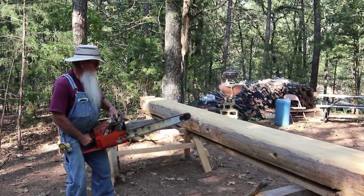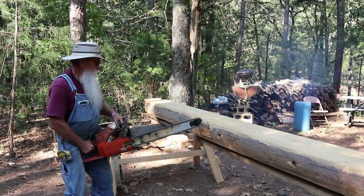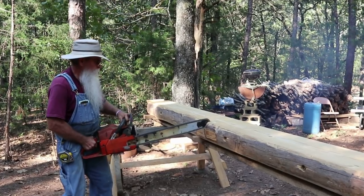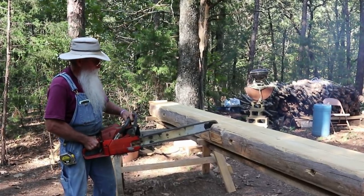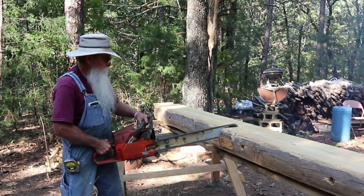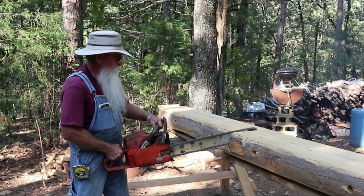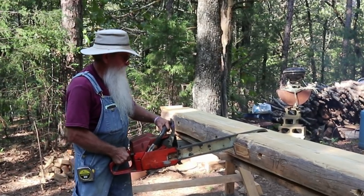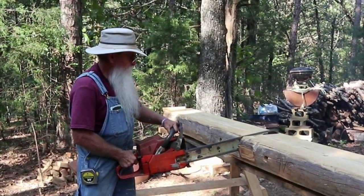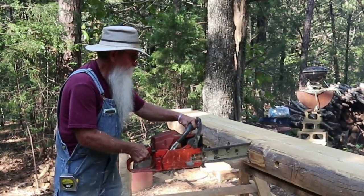And in round five, which I'm about to start setting, I'm up into the windows on B and C wall. And so what I've done is work all of these as one log. I've had to use two different center lines on some of them, but it just makes it so much easier to haul to get down here. But I'm going to cut this one too and get A, L, and AR up on the wall.